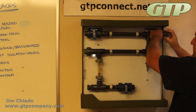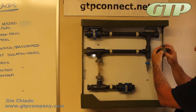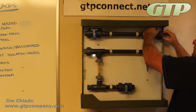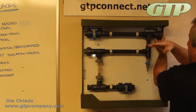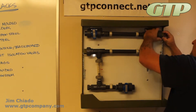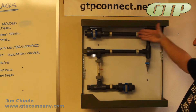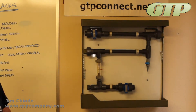On the carbon steel version, we also have an injection molded one, but you'll see there's also an arrow on these indicators which will tell you which way the sample faces, so that you can keep it straight up and down and avoid debris settling on the sample if it's lying flat. You should have flow anyway, so you really shouldn't have any debris sitting on it, but if someone isolates the system, the flat surface orientation makes sure that the samples are positioned up and down correctly.